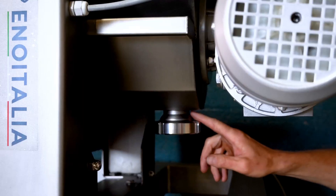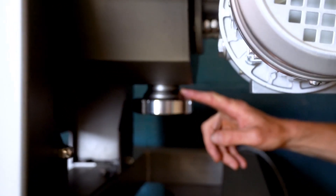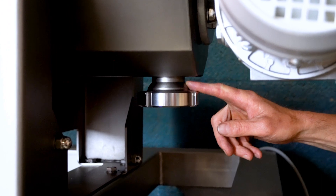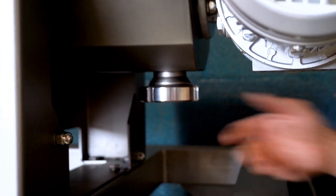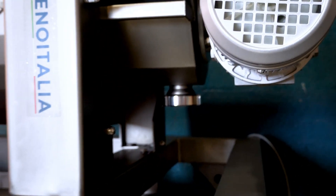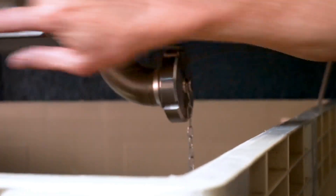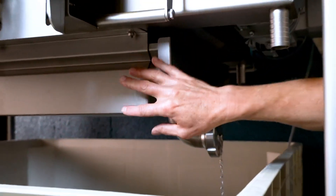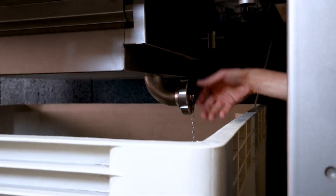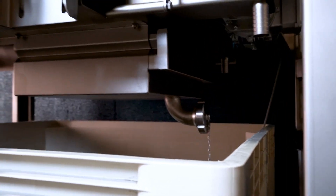On the bottom of the receiving hopper in the Jolly 60 you'll see a connection for removing oxidized juice — this is the first point in the system where oxidized juice comes out and not into your fermenters. You connect a tube onto this fitting and run it out into a bucket or garbage can. The second way oxidized juice is removed is in the sorting process: there's a stainless tray where the oxidized juice comes down first, and that will also come out via a tube into a bucket and be collected separately.